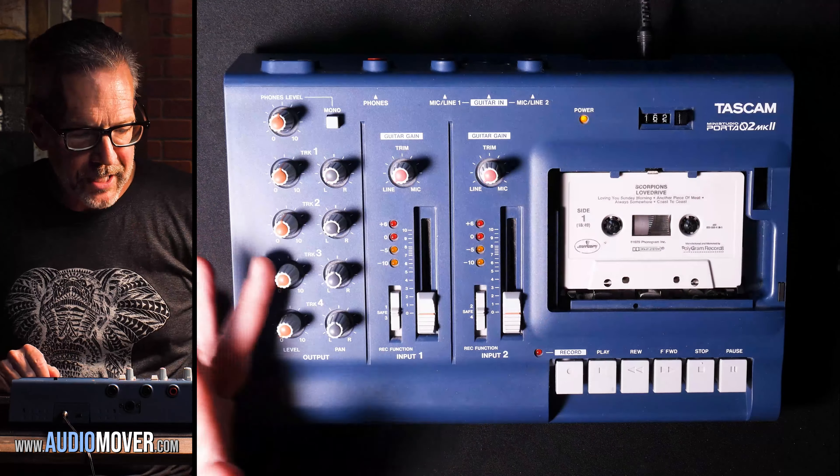What we do here, if we're playing a stereo tape in this deck, is we turn it up so that we have the left channel and right channel on side A turned up about halfway, and left channel and right channel on side B turned all the way down. Then on side A we pan the left all the way to the left and the right all the way to the right. The side B channels don't matter in that configuration.